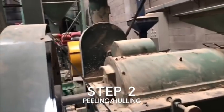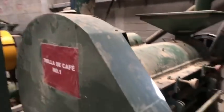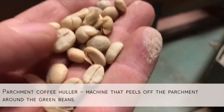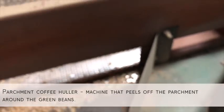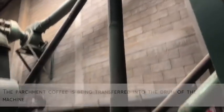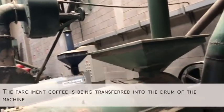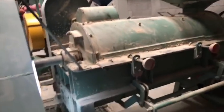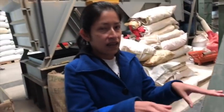The second process is made in these two machines. This one is taking out the parchment — it's like peeling the bean. The top goes inside of this drum. Inside the drum there are two pieces which move, and they kind of crush the coffee and take out the peel.